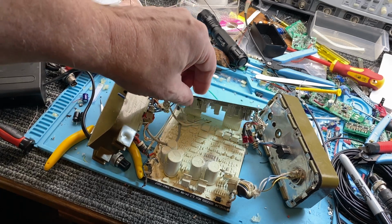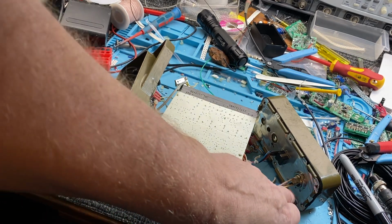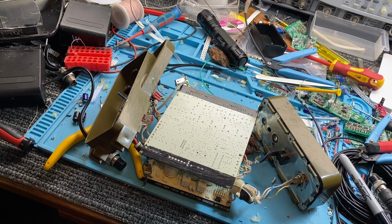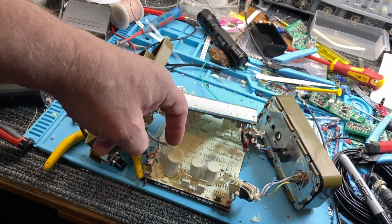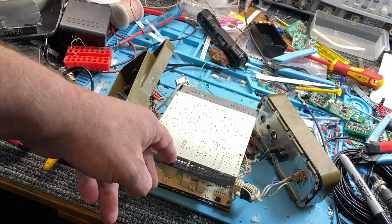And what I actually noticed is that someone had rewired the coil connector, and they did it completely backwards. So it was basically pumping transmit voltage directly into the receiver. So yeah, but I rebuilt him. He's okay. This one had modifications in it.